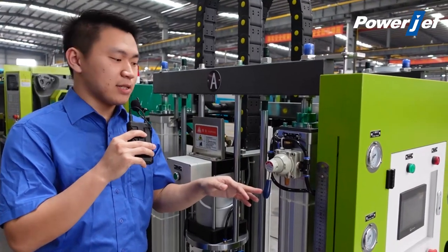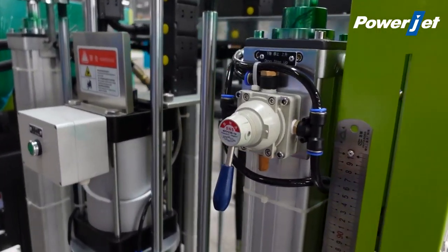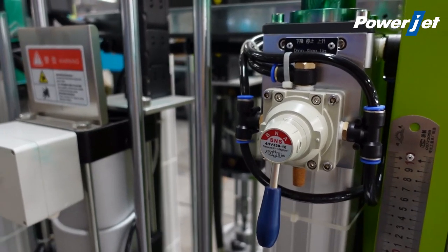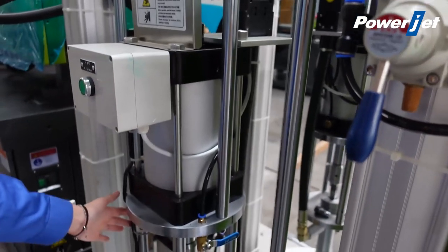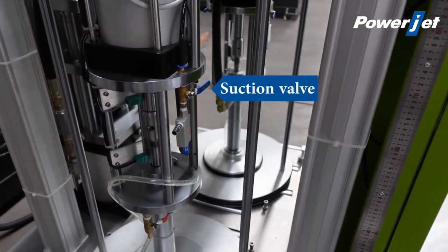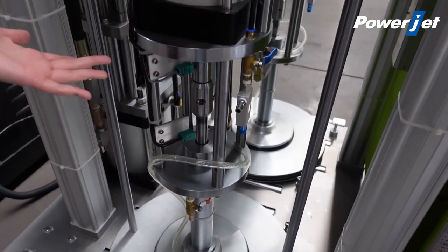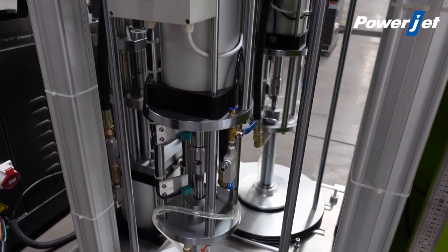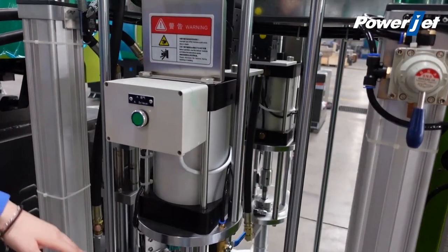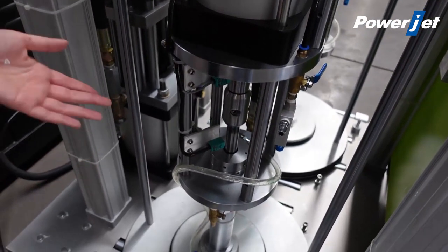This wheel is for lifting and lowering the platen in manual mode. This is the blow valve and this is the suction valve. If we want to take out the barrel from the feeder platen, we blow air into the barrel and then we can remove the barrel easily. When we want to load the material onto the feeder platen, we exhaust the air and make it vacuum.